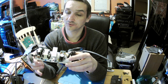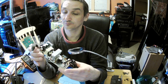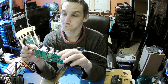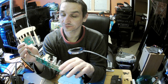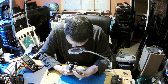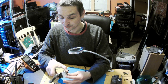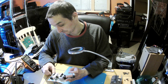There is no optocoupling, so, oh no, there is some chip here. I don't know what the chip is. Maybe that's an optocoupler. If that would be an optocoupler, it's because it has white goo on itself. So maybe, just maybe, the standby is here. But no, it was constant. Why I know? Because it's only three VCCs and three grounds. There's no standby on it. I'm talking rubbish. Yes. Correct. VCC times 3 and ground times 3. We've got no standby voltage here, so that won't be an optoisolator. So the only bet I could do here would be this MOSFET. If I remove it, we won't have a power.